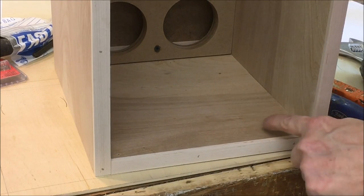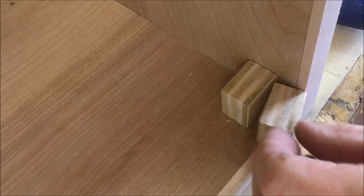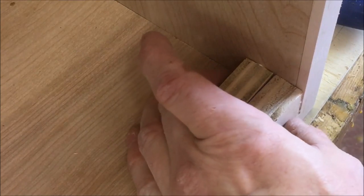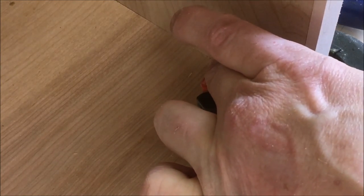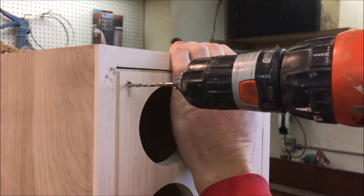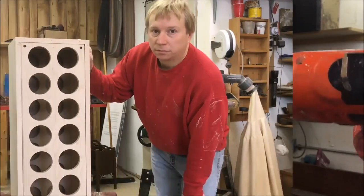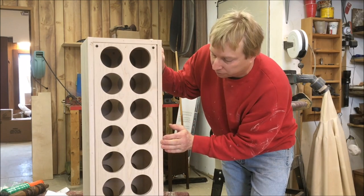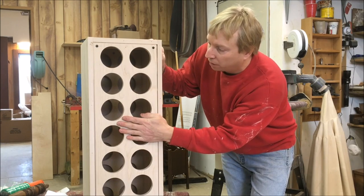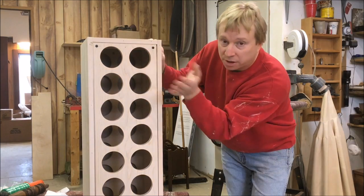Now we've got that nice decorative groove or reveal. Next up is to make some small mounting blocks for the inside corners — I want to screw the panel from the front side with some decorative screws. They're just little one-inch square pieces of plywood; I'll put a little glue on them, space them in three quarters of an inch from the edge, and clamp them. I've got the cabinet all done — just have to do a final sanding and staining. The inside is going to be painted black so it disappears. This front cover is removable so you can take it off to hang the cabinet, put screws in, and then put the cover back on. These black screws will just kind of disappear — it's going to be a dark stain.